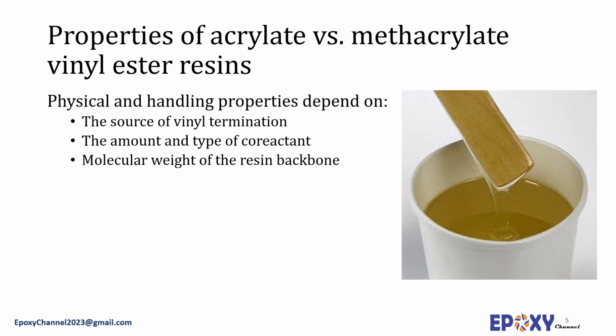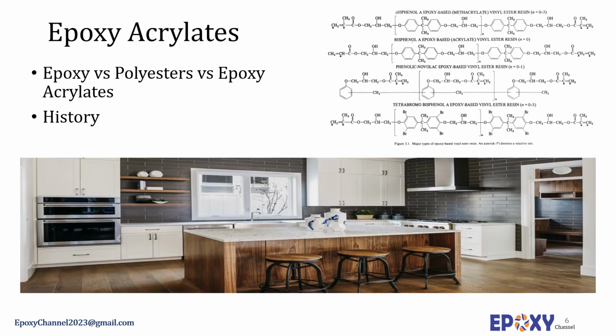Epoxide backbones of various molecular weight are used in vinyl ester resins. Higher molecular weight produces greater toughness and resiliency, lower solvent resistance, and lower heat resistance. Unlike polyester, vinyl ester resins possess a low ester content and a low vinyl functionality, which result in greater resistance to hydrolysis as well as lower peak exotherm temperature and less shrinkage upon cure.